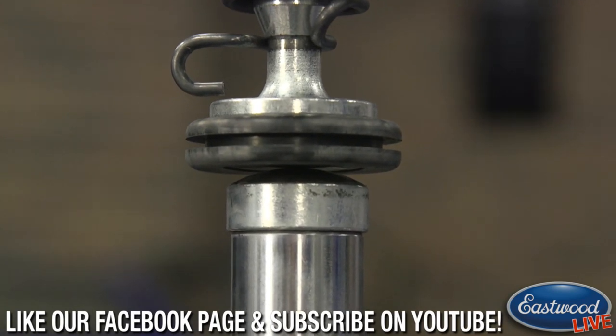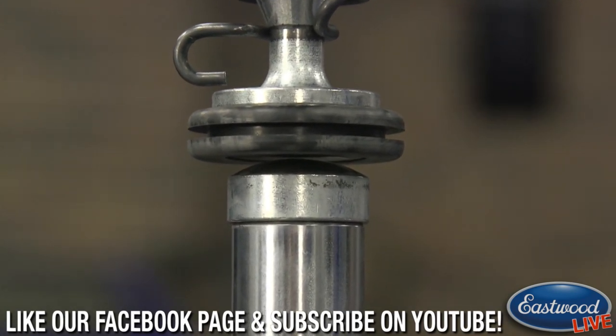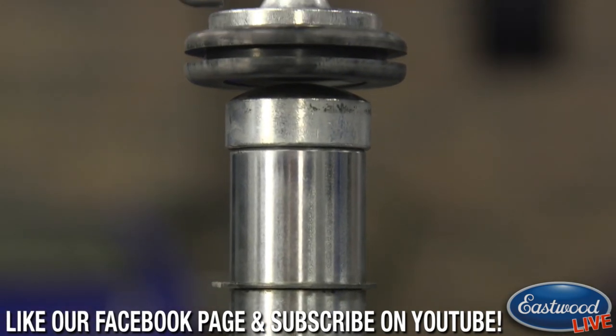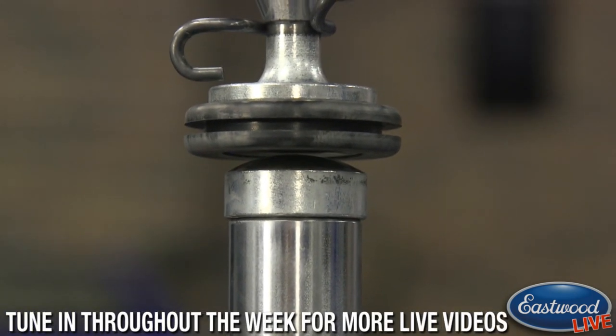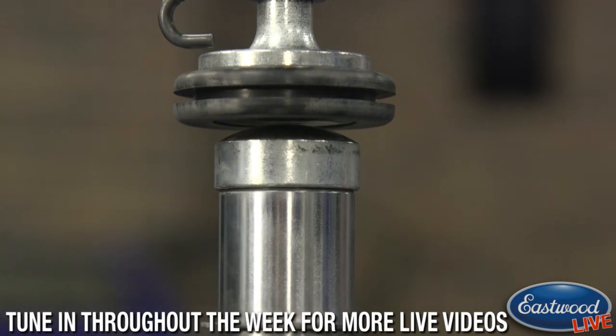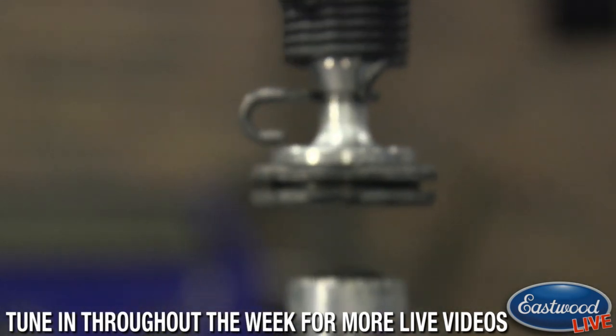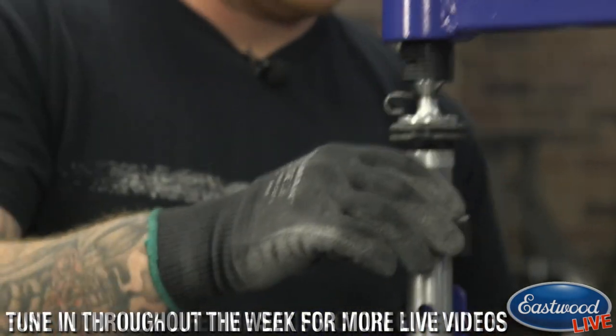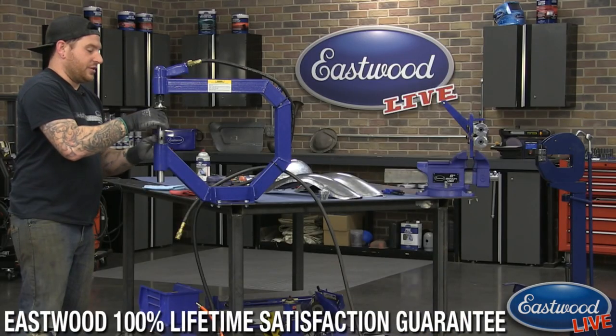That's why using these smaller dies is really nice, because you can get in a nice tight area there and smooth out any damage in the metal by doing that. So you want a flat top most of the time with a radius bottom. That's kind of the process, or the most common combination, rather, I should say.